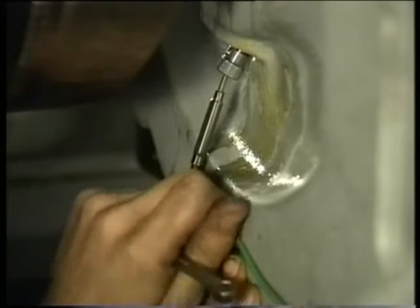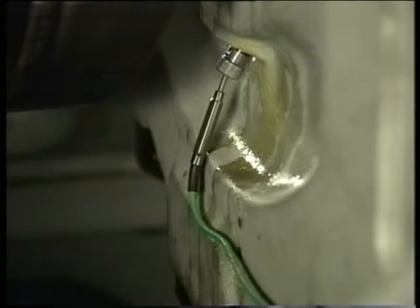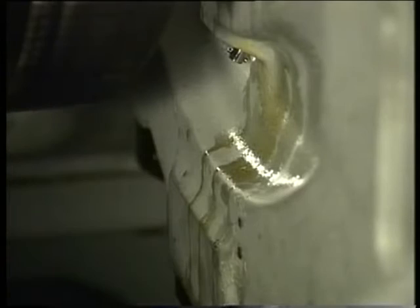The engine is equipped with a bearing monitoring device. A sensor is fitted on each main bearing cap. The sensor can be detached by disconnecting the banjo union. This must be done before the main bearing cap is loosened by jacking.